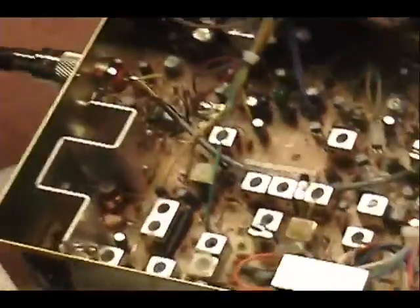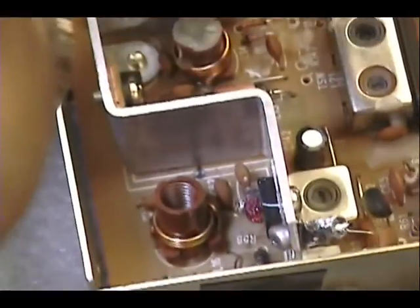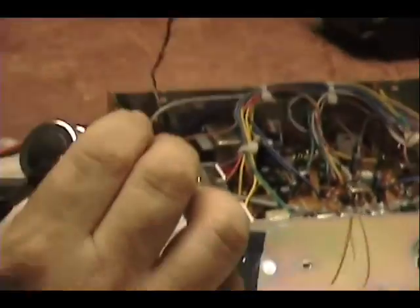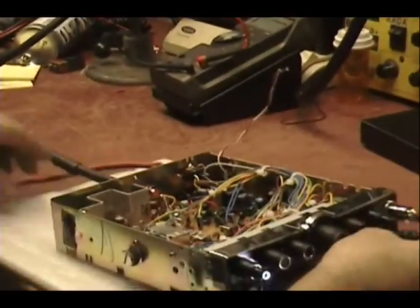I said I gave it a visual but I guess I didn't look too hard. Can you see way down in here — that resistor right there? It's a little dark. There's definitely something burned out right there. It needs to cross over to get into the base of the transistor, and it burned out. I'm going to replace that, and there's a good chance the driver transistor is bad too. But let's start with that and see what we've got.